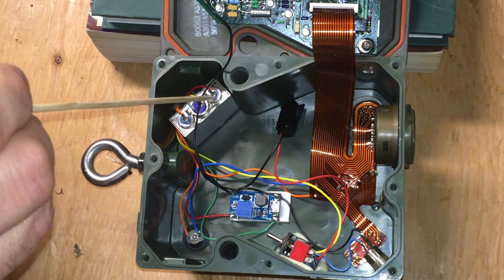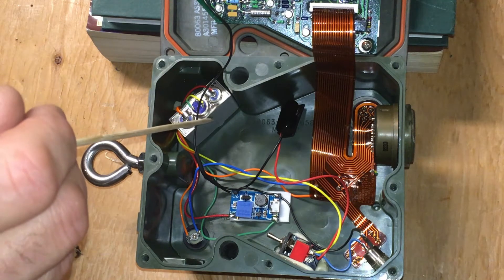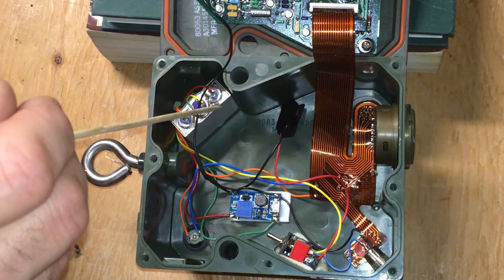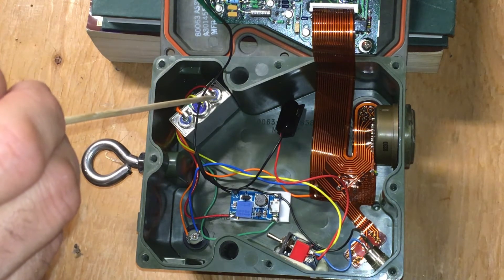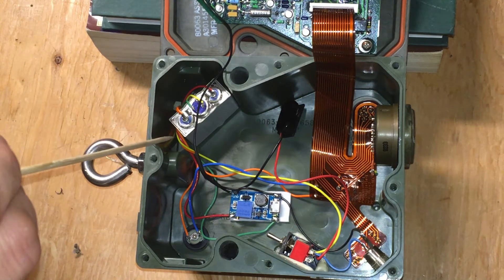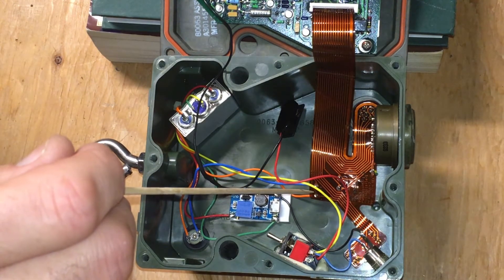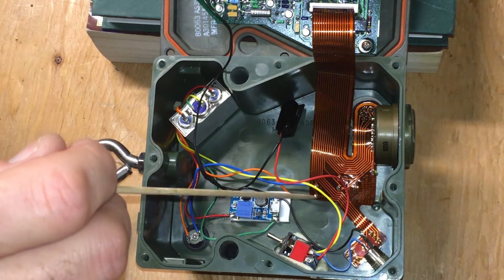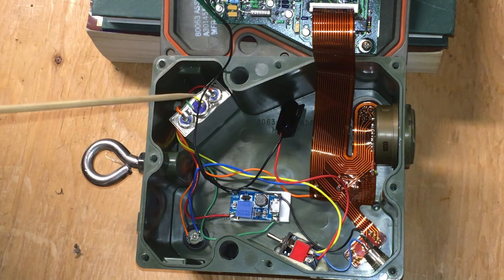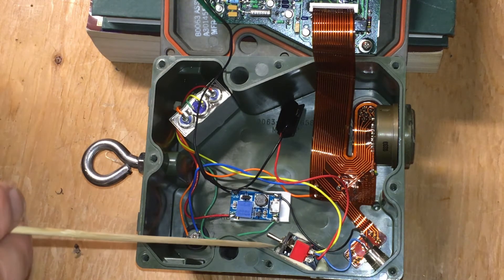Pin C goes up to one side of the circuit breaker. When the original switch is flipped on, it turns the circuit breaker and the switch on at the same time, and positive power crosses over the circuit breaker to the orange switch wire, which follows down to the original ribbon cable and powers the electronics package of the speaker.